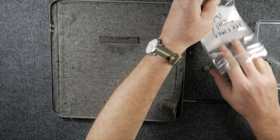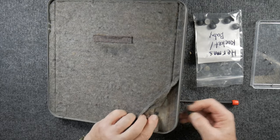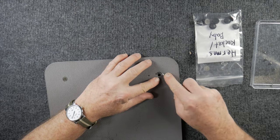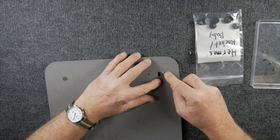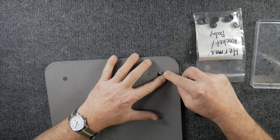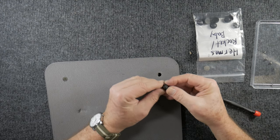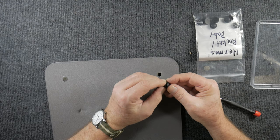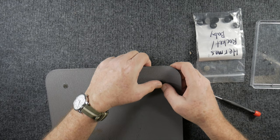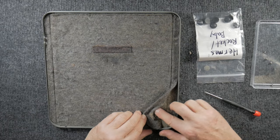Turn the bottom of the machine upside down and you'll find that around the hole where the foot was there's a lot of old, plasticky, hard material that you're going to want to carefully scrape off without scratching the paint on the typewriter. When you get that off, carefully push the new foot on — there's a little groove on the new rubber foot. Press it in and rotate it to make sure the groove is properly seated, then repeat the same procedure on the other three corners.